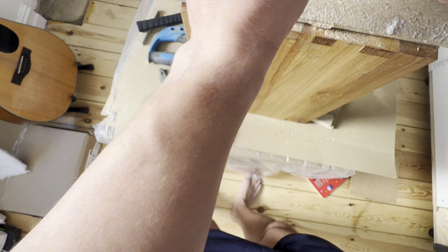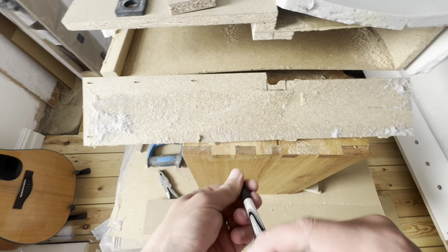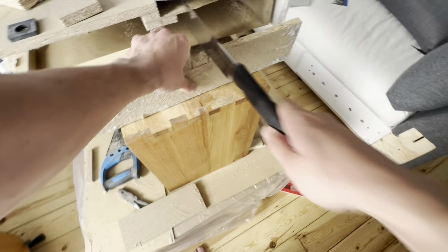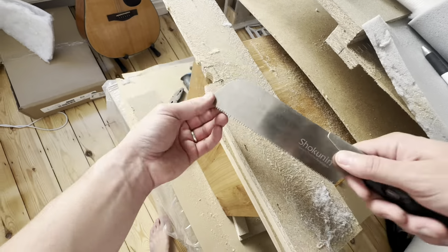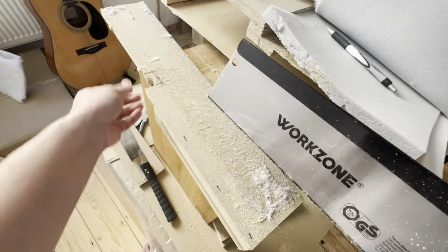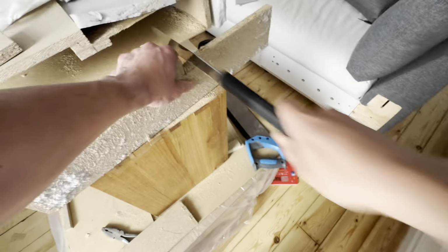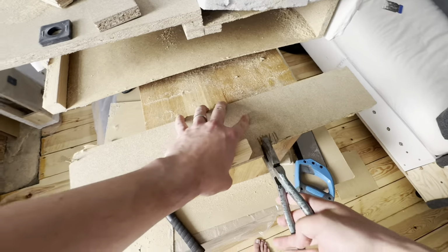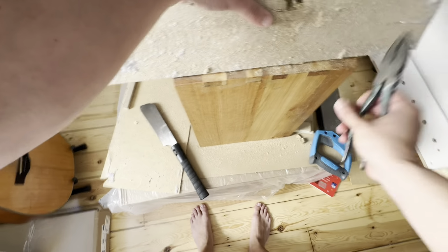go down to where it is, and then line it up again with this edge across the way, and then underneath, keep it steady, score, just so you know. Obviously you don't have to go along this far, just to the edge of it, and then you can, with your saw, cut it. It'll probably fall apart anyway because it's all chipboard, but you can just cut more lines into it. And then this stuff falls apart like Billy-o, as you can see.